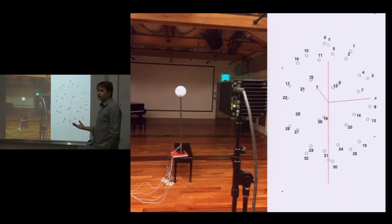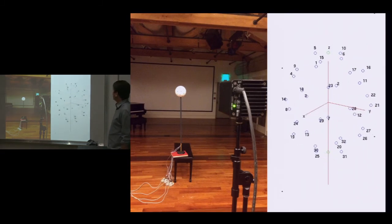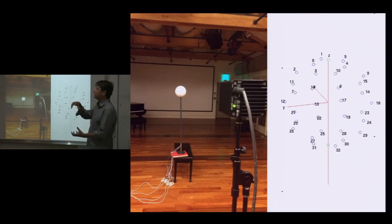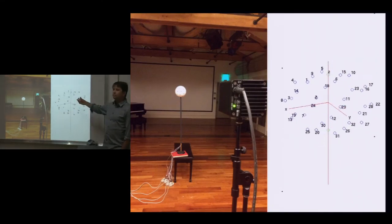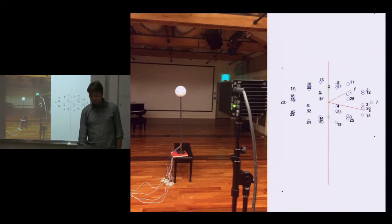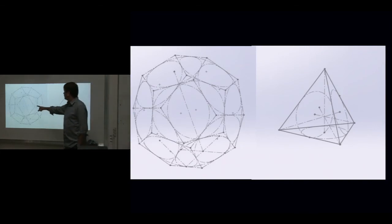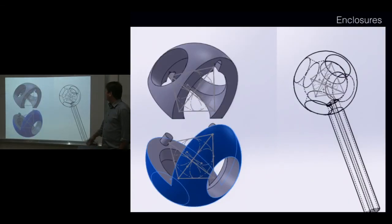So that is also a case of replication, because these microphones already exist. But with the ability to customize the geometry, we can imagine now having all kinds of different shaped spherical microphones. If we moved from a spherical case to a lenticular case where it was smushed, we have an interesting possibility of having a higher density of microphones where they actually make more of a difference on the azimuth. So this transformation from dodecahedral 32-channel microphone to a tetramic is one variable change in the polygon count. So we go from that to an open source tetramic for ambisonics that Fernando Lopez Lascano has now taken off with his tetramic, which is all open source and uses the OpenSCAD library as well.